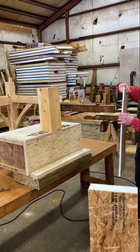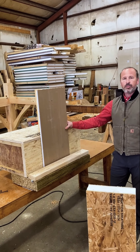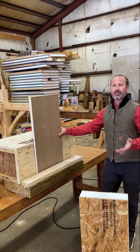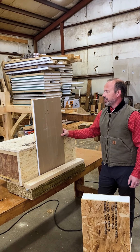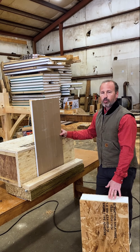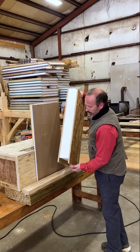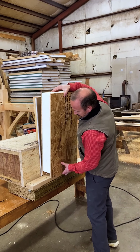One of the first things we'll do once the timber frame is up and we're ready to start enclosing is hang gypsum. We've got half-inch gypsum sheets and we'll put them in place either vertically or horizontally depending on the spacing of the timbers, trying to cover as many gypsum joints as possible behind the timbers, holding them in place using roofing nails. You want to put up just as much gypsum as you're going to cover with panel — you don't want to leave gypsum hanging out overnight. So we'll put up maybe one wall of gypsum and then swing in the panels. With this SIP, the bottom inch and a half of foam is removed so it can sit over the shoe.